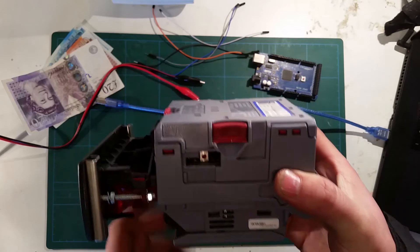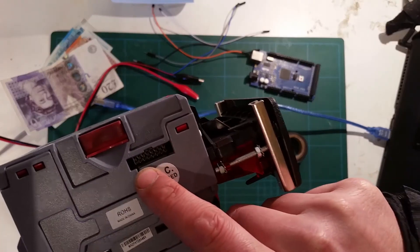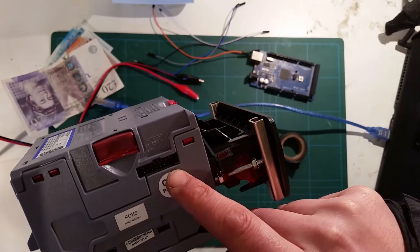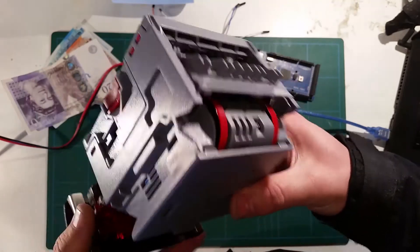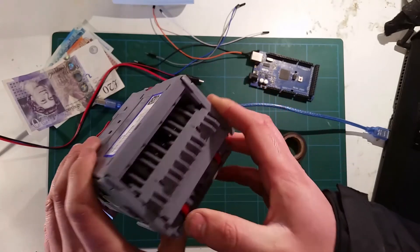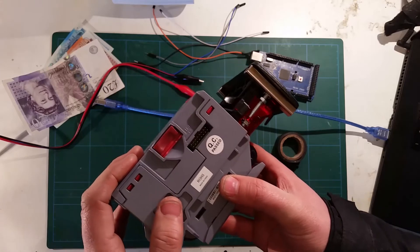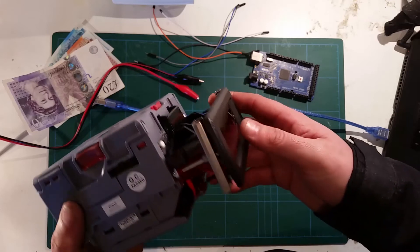Here you've got one programming button. You can see the pins — the pin header. You've got 16 pins there; that's where you connect them to communicate, for power and different interfaces. You can set up different interfaces with this, but the easiest I find is using serial. The company who make these don't recommend it simply because it's not secure, it's not protected, it's easily hackable.